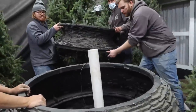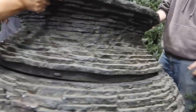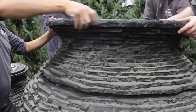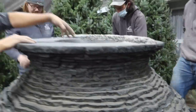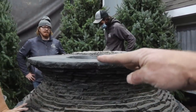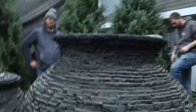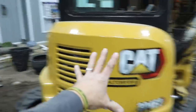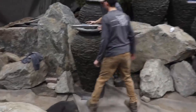We fished the lighting cable through already and got the lid on. We put a little bit of foam on top from the last time we used this at a home show. We're going to keep that bead where it's at - we want a majority of that water to come off the front of this. We're actually damming up the back side, forcing more water to come off the front, which is the main viewing area coming across the pond and the patio. That's why that ribbon of foam is sitting on top, slightly pitched forward.